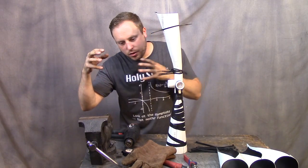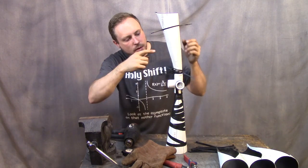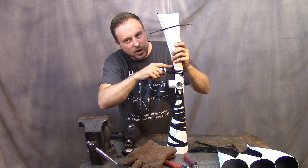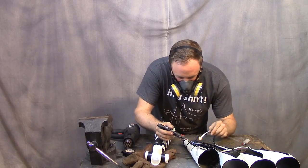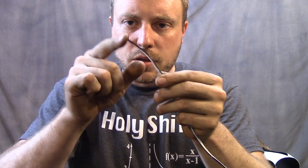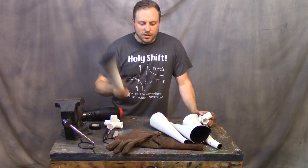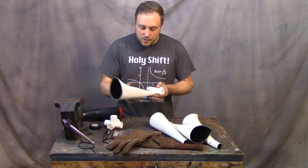That's what makes PVC dangerous — it's chlorinated, so it doesn't melt, it just burns, and then it releases noxious gases that kill you. ABS is acetylbutylstyrene — something like that. The point is I can melt that seam with a torch and melt it together, which would be awesome. But to make a long story short, I could melt the pipe together with heat, but it was incredibly difficult. It was almost like I needed flux to get the plastic to stick together. I tried a whole bunch of different techniques and it ended up looking super hideous, but eventually I got it done. Every time you build something it's a learning process, and this time I learned that ABS is an absolute nightmare to plastic weld.